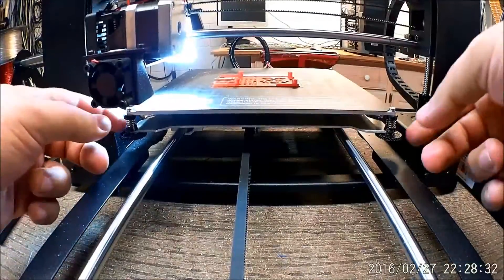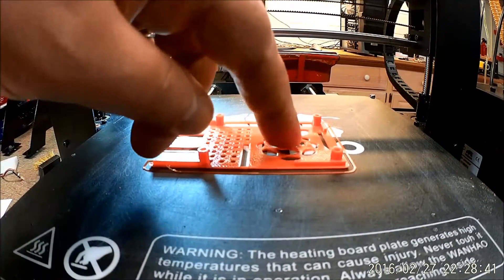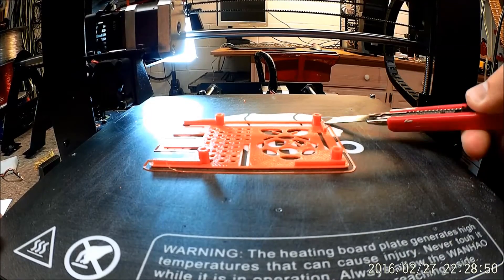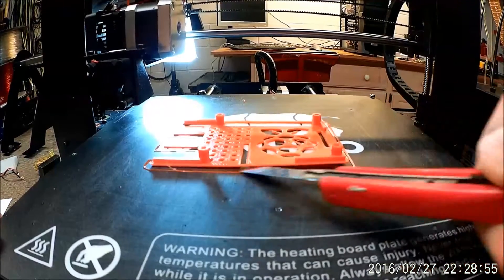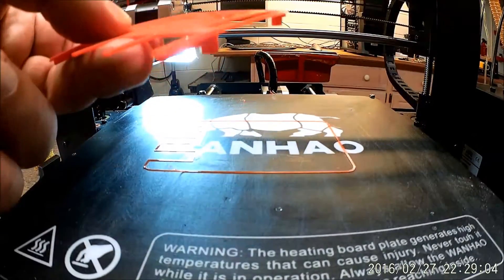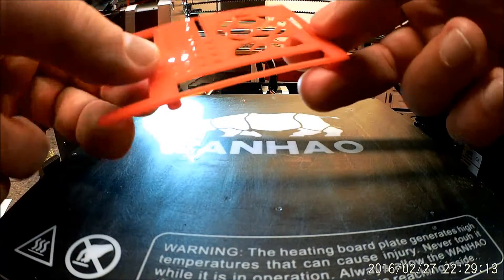Okay, well welcome back. I showed the two time lapses because we redid the base. Now this one came out okay except for a little bit around the raspberry right in here. So I'm going to try popping this one up. Now one of the things that you didn't see is this is actually about the third print. I had to actually, in order to get this one to come out, really realign the bed and do a really good job at lining bed height. Because it was a little bit of a problem — I was still getting adhesion issues because these fingers are so small they really didn't want to stick.